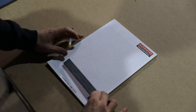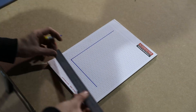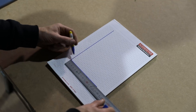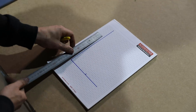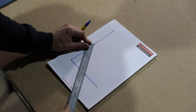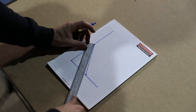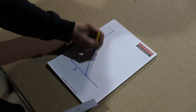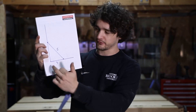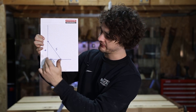As a brief overview of how this guide works - if I just draw a quick right angle - the guide works through basic trigonometry, more specifically Pythagoras. So if we assume a triangle is three units across and four units up, that distance diagonally should be five exactly. In millimeters: 75mm across, 100mm up, and 125mm diagonally. Simplify those measurements and it's three-four-five. Whether that's three miles across and four miles up, or three microns across and four microns up, it will always be five diagonally. Stick to those measurements and it ensures a perfect right angle - basic trigonometry.